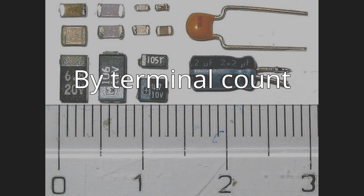Surface mount components are usually smaller than their counterparts with leads, and are designed to be handled by machines rather than by humans. The electronics industry has standardized package shapes and sizes. The leading standardization body is JEDEC. The codes given in the chart below usually tell the length and width of the components in tenths of millimeters or hundredths of inches. For example, a metric 2520 component is 2.5 mm by 2.0 mm, which corresponds roughly to 0.10 inches by 0.08 inches.